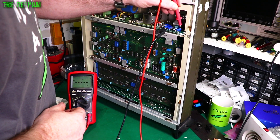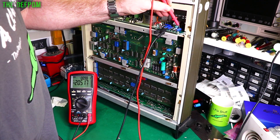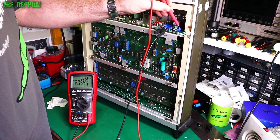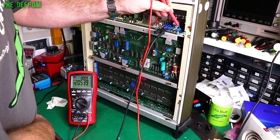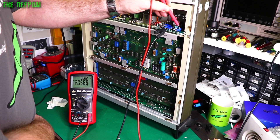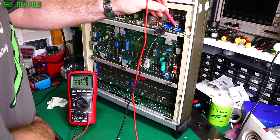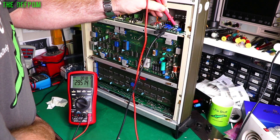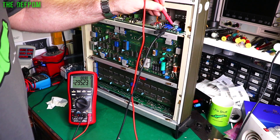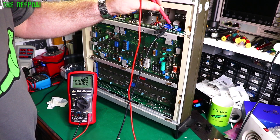Let's measure here — that's about a 20-volt supply. 20.5 volts. You can see the ripple measurement settle down as it's sampling — nothing too horrendous there. Next one — this is a 30-volt supply. Same deal, looking all right. This is a minus 30-volt supply — all looking very equal. A little bit half a volt down though. Not sure if that really matters much — I think it's plus or minus one volt allowed tolerance.